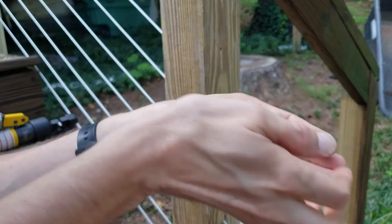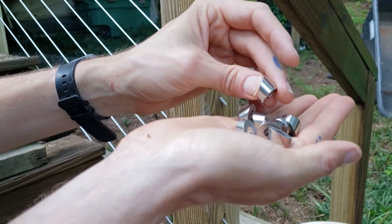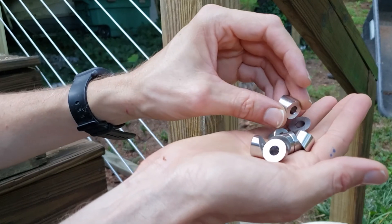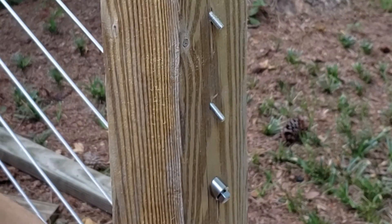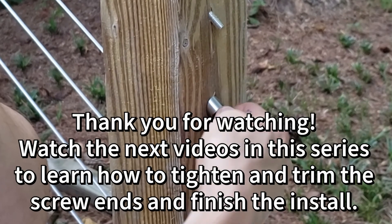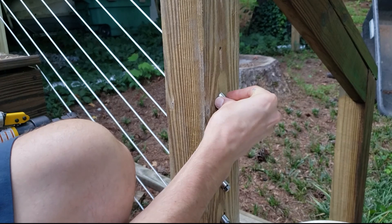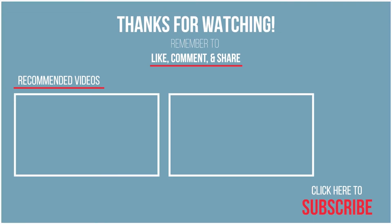The other main difference with the steps is that we're going to be using angled washers — these are 30 degree angles. You can get them in a few different angles like 30 or 45, although most are at 30 degrees, which is like most steps. However, my steps are 35 degrees, but it really didn't make too much of a difference — they fit okay, especially once I tightened them down. They're going to dig into the wood anyway, and you won't see that five degree difference. The way these work, you take the angled washer, put it on here, and put the nut on the end.